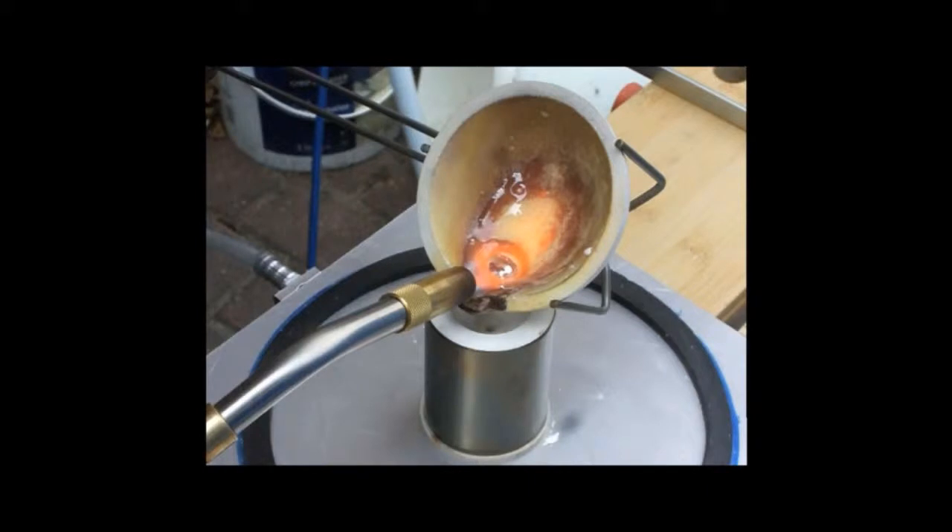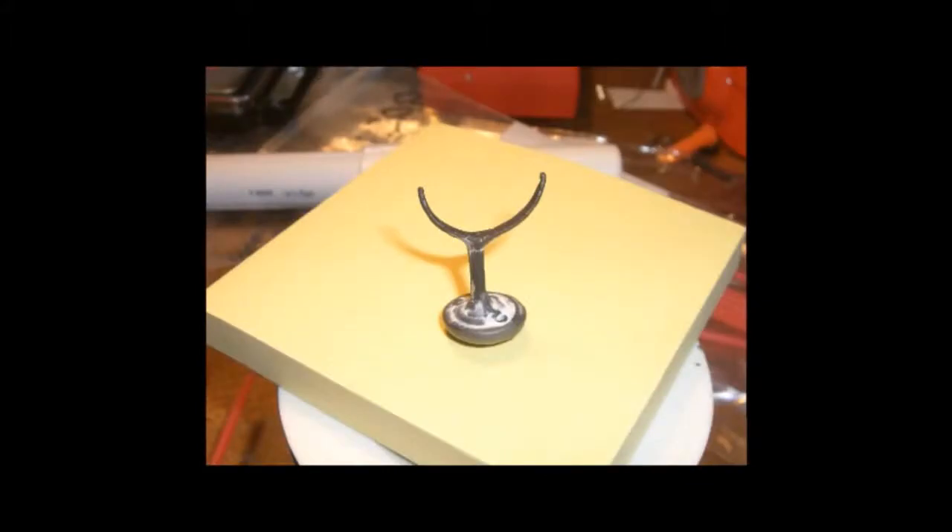You melt the metal you want to pour into your mold with a blowtorch and a little crucible of high-temperature ceramic, then pour it in the top. The chamber here was used to suck air out the bottom of the ceramic through the pores — but I couldn't get this vacuum process to work after 10 tries. Maybe my vacuum pump isn't strong enough, or the investment material is too thick, or I hadn't baked it correctly. When it didn't work the ring only flowed around halfway because the air wasn't escaping. So instead I built a little centrifuge — the other way jewelers make things. This is made out of a sewing machine and a bicycle wheel, with a curry dish as a safety shield. You heat up your metal in the crucible, put your flask in, and spin it — the metal gets pushed into the mold with much more force than the one atmosphere available with a vacuum. You can just turn up the speed to get more force, and it worked very effectively.